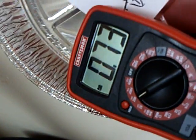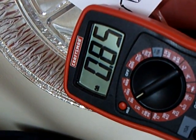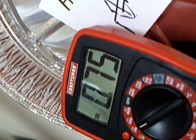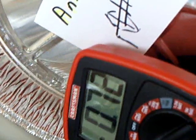I come back in the house and I'm going to start picking up voltages. I found out even if I go over to the wall here, near the light plug, I'll pick up voltages off the wall. And I'll get voltage readings on this antenna right off the wall of the house. This is what threw me off — I was picking up stray voltage from the house, and that was giving me a false reading on what was actually happening.